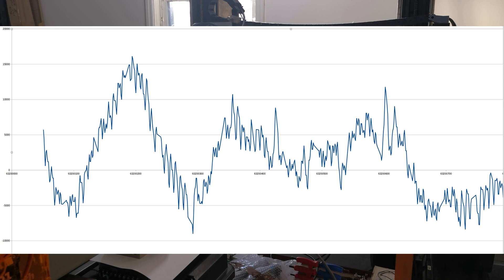These are happening rather slowly from the point of view of the cutting bit. More relevant in terms of stress on the cutting bit itself are the large single-sample data swings at higher frequencies. The largest of these seem to be about 5 microns over a single 600 Hz interval. This can be a problem for smaller cutting bits — a 1/8 inch end mill may only take a half of a thousandth cutting depth in some materials.